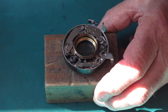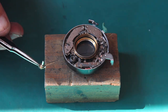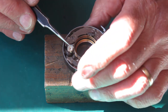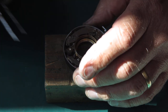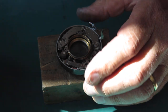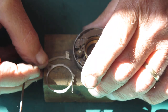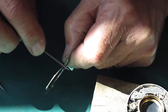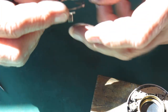A few other bits and pieces to go in yet. This little pinion needs to go in — I'm just going to give the shaft of that a light wipe of molybdenum paste. When I use that I put virtually nothing on; you're just leaving a dirty mark, that's all that's required. This piece with its return spring — I run the molybdenum paste around the inside edge, that's where it runs around the lens tube, and around the outside edge where it operates against various other bits and pieces. That suffices.